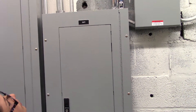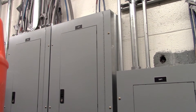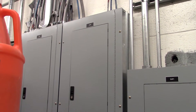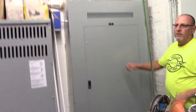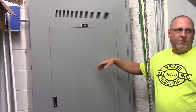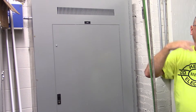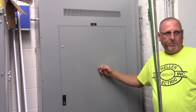Receptacles are low voltage. LRP-1 for these panels, that's pretty much all the 120/208 power throughout these areas, like the classroom plugs and stuff like that. This down here is the distribution board. This right here is fed out of this transformer — it steps down to all the other low voltage panels in this area. We'll walk through the hallways. That feeds the classroom lighting and the stuff located throughout the hallways. They're fed from here. Kitchen panels are fed from here.